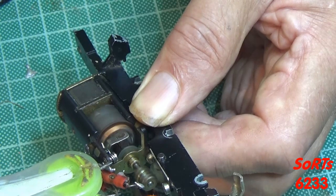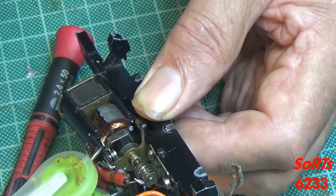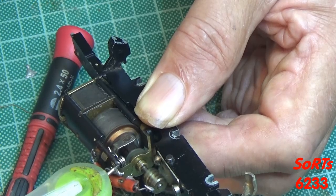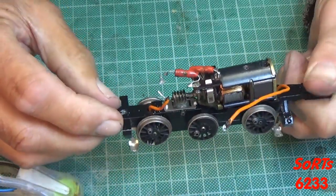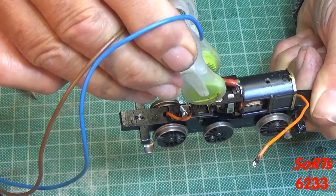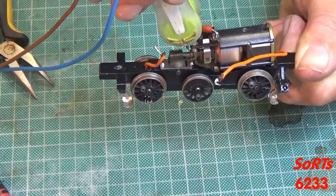And would you look at that — that's less voltage than I had earlier when it jammed. Moving that little bit of debris from the tooth of the idler and there we go — turning in the correct direction now. Swap direction — still fine. Let's try and put this machine back together again. I'm starting the rebuild again — wheels held in with the base plate — and applying a small voltage, it runs fine. That is running in the offending direction and as you can see it runs quite smoothly.